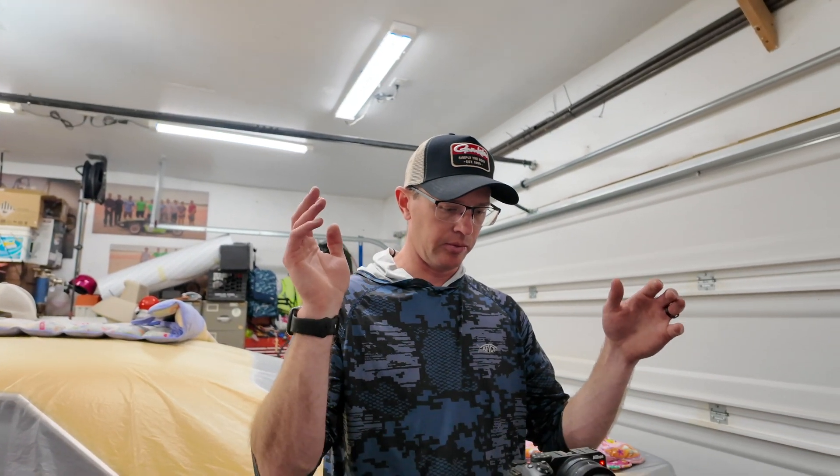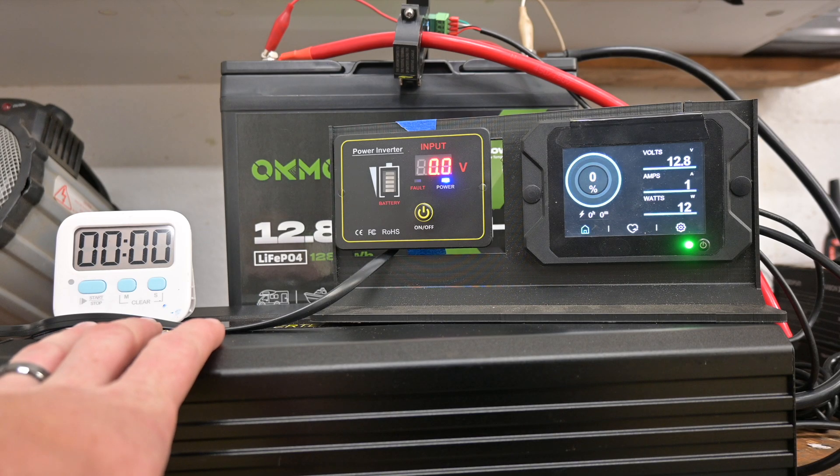Performance-wise in the boat it's been just fine, and we just finished our testing with our 2500 watt inverter — I had to step up from a 2000 watt inverter for this one. Results of these tests vary quite a bit: some batteries kick out within a couple of seconds over 100 amps, while others are temperature-based and take a while for the MOSFETs inside the BMS to heat up enough to drop out the discharge. With the 2500 watt inverter we now have enough power at 12 volts to really push it.